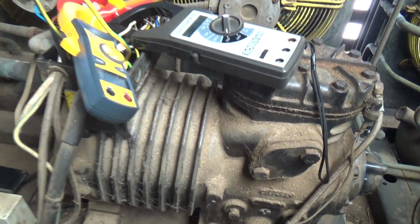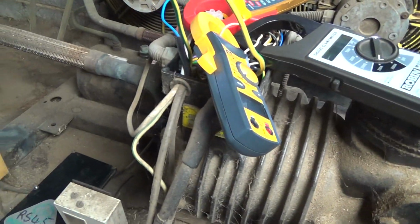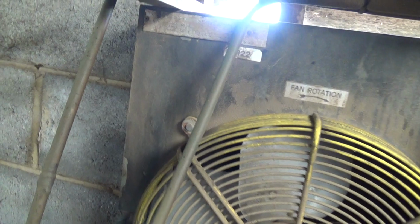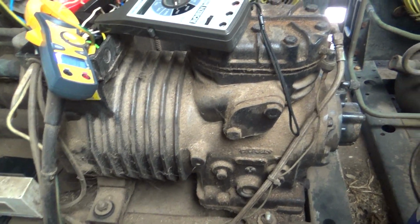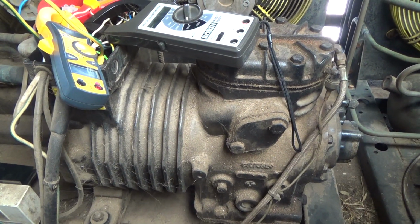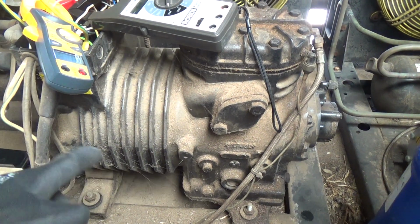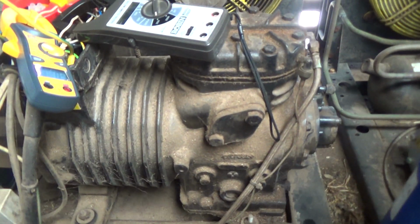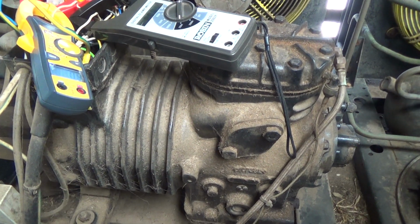It's a 5 horsepower. I think they're a PLG 500 something or other. You've got an oil pump on there, but it's the same block they do the 2 horsepower ones in, and I think they've stretched it too far. Every one of these I've seen has been trouble. Put it that way.